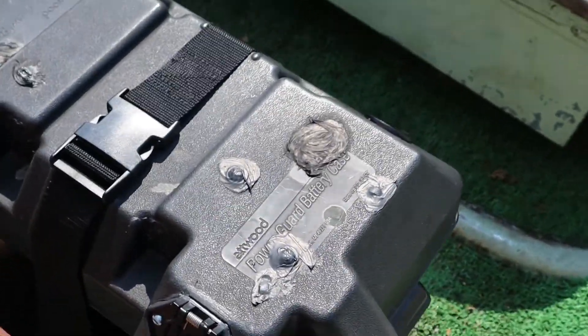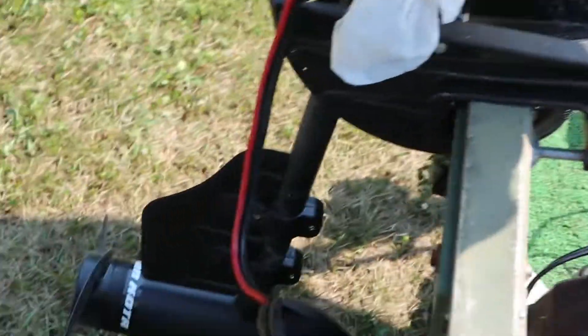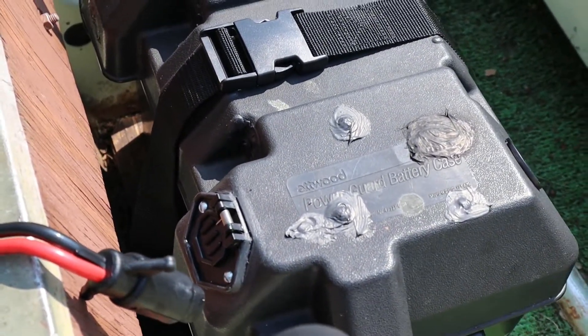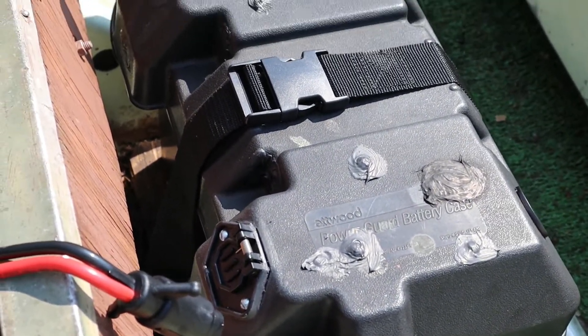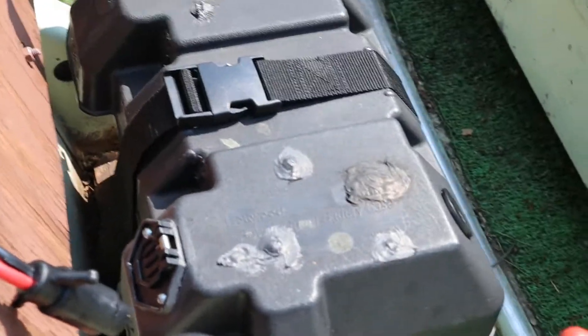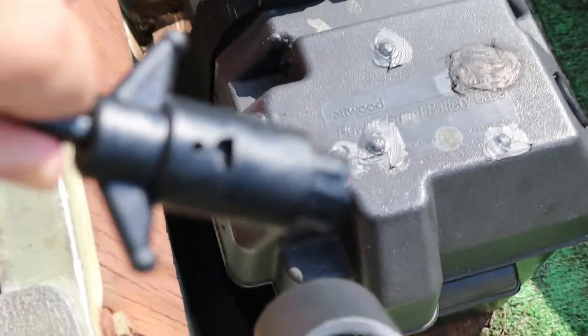So now when we take the boat out of the water, it's always dangerous because if someone bumps the handle, you've got to worry about that prop down there spinning. So now we just keep it disconnected and we hook it up. It plugs in real nice, and when it locks in the cover locks it in, and there's a little pin in there - it's keyed to go in one way.